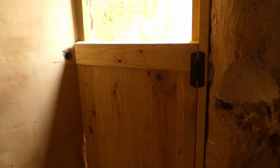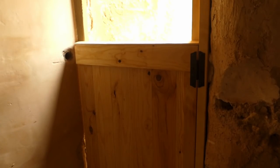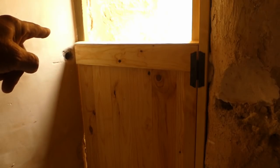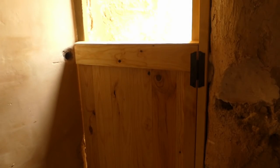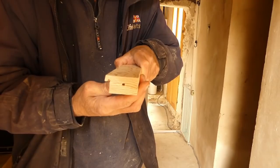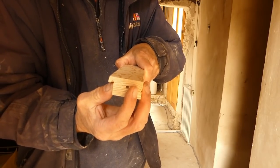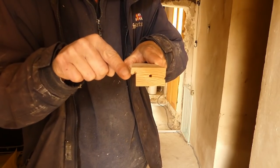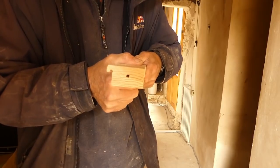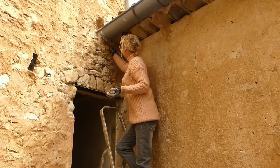The easy one's cut for the top of the door here and it slopes up that way, so when the other door closes against it it'll have the same slope — I can put a strip of weather seal along it. I'm not very good at this pointing thing. When they meet they'll be sealed. The problem now is making the piece for the top door. We've got two pieces: the bottom piece will sit on the bottom door at an angle, so when they close it'll seal. Any water that comes down will get to the drip head and drip off and not run into the door. So all I've got to do now is get the bottom one fitted to the bottom door and get the top door made.